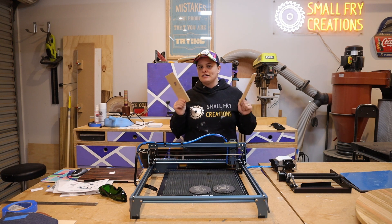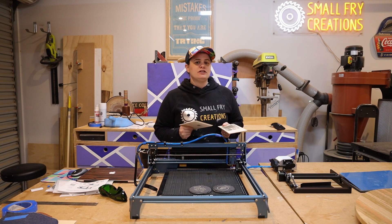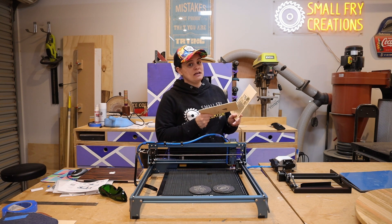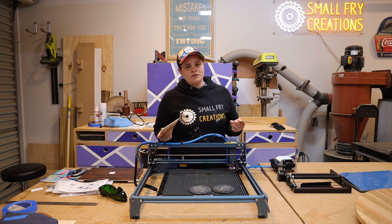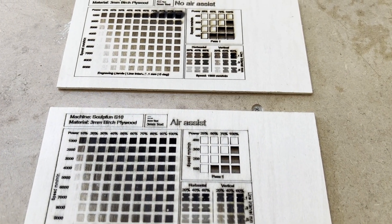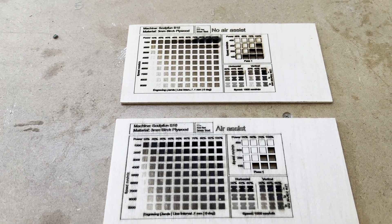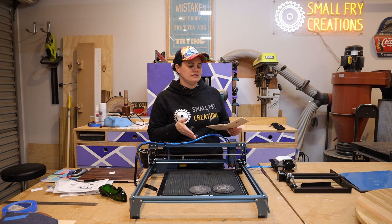Let's have a look at these test files. These test files come from the Make or Break YouTube channel — I will link Brandon below. He is a fantastic resource if you're looking at getting into lasering because he has reviewed just about every laser on the market and provides these test files free of charge. Thank you Brandon. The first thing I notice in the test results is that if I'm engraving I don't want to have air assist on because it just pushes the charred timber around and starts to smudge the project. If I'm cutting through timber I definitely want to have the air assist on — this is really when the air assist comes into its own.